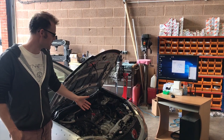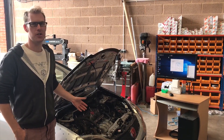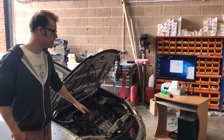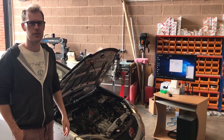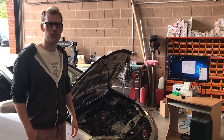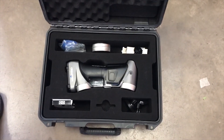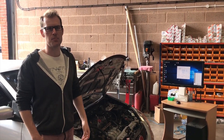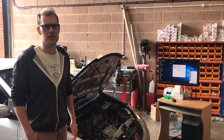Okay, so we're about to start the process of scanning this engine bay so we can work on a number of projects. One of them is a supercharger kit — we're just checking for clearances so we can basically assemble this bonnet and engine bay in CAD, take our clearances from it, and then align our supercharger CAD models just to see how it's going to fit and check there are no clearance issues. To scan this engine bay we're using a Creaform HandyScan 700. It's a metrology grade laser scanner — it can pick up details as low as 0.05mm, which is probably overkill for this, but it's definitely a good bit of kit to use.